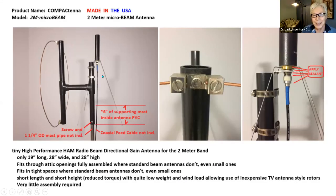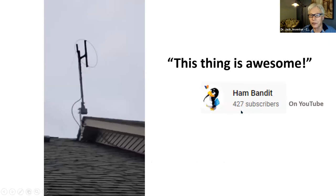The Microbeam — a cool, very small product. So small that built entirely, you can get it into an attic. You can put it on a chimney mount or pole mount in the back and it'll hardly be seen — it looks like vent pipe. I made it small by using this antenna as the driven element, and taking advantage of the near field so the spacing is smaller than usual on a directive antenna. Reducing the vertical size on the reflector by using a full loop, then benefiting from horizontal spatial characteristics and gain from the loop — the bottom line is a much more powerful antenna than you'd think for such a small size.